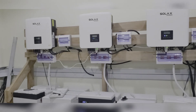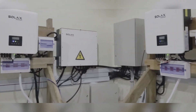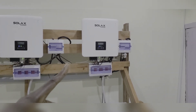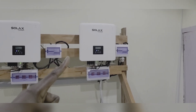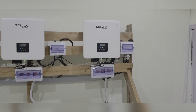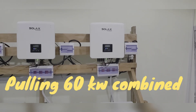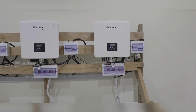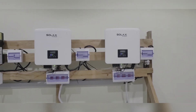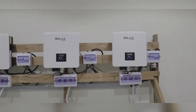The place has been running on this system, averaging 10 to 11 hours. One thing we still need to do is connect the automatic generator start function. Since this master has fewer batteries for now and this one has been pulling a continuous 30 kilowatts, we'll configure it accordingly. When the battery depletes to a certain point, it sends a signal to start the generator, and once the battery state of charge reaches a certain point, it stops the generator and continues running on battery. Hopefully that will be done by Tuesday or Wednesday next week, and it will allow us to automate the generator so we don't have to call them every morning and evening to put the generator on.